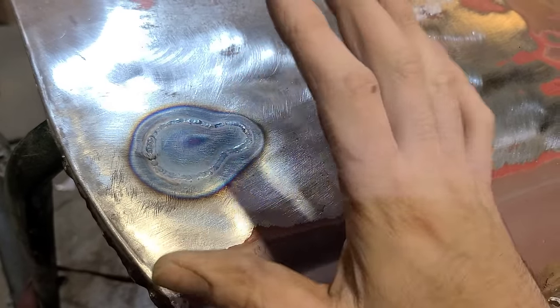I always get comments from people saying that they can somehow weld things without any warpage or shrinkage at all, and unless they're living in some alternate universe where the laws of physics don't apply, that is a bunch of nonsense. Yes, you can weld things and get very minimal distortion, especially if you're using a MIG or whatever, or really taking your time, but again, you're never getting away from it 100%.